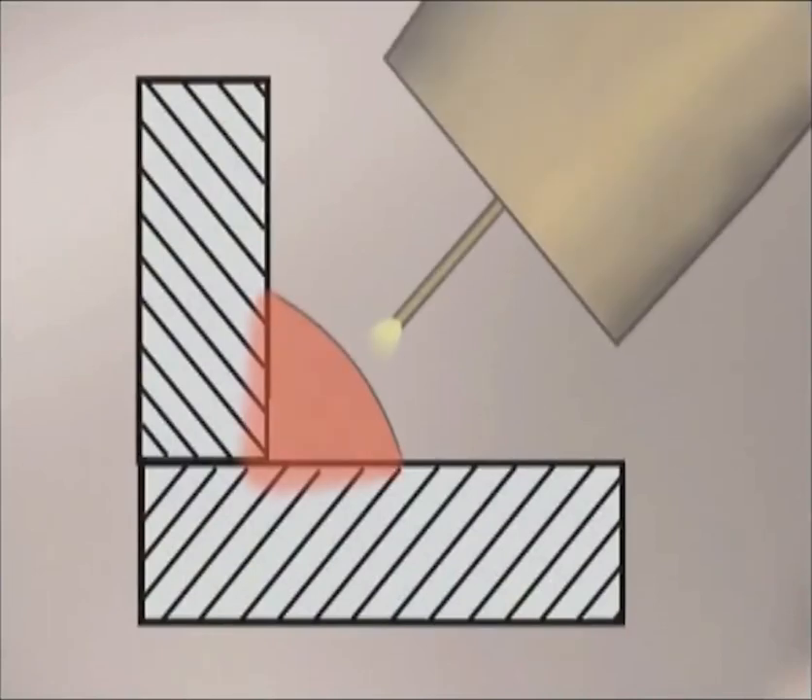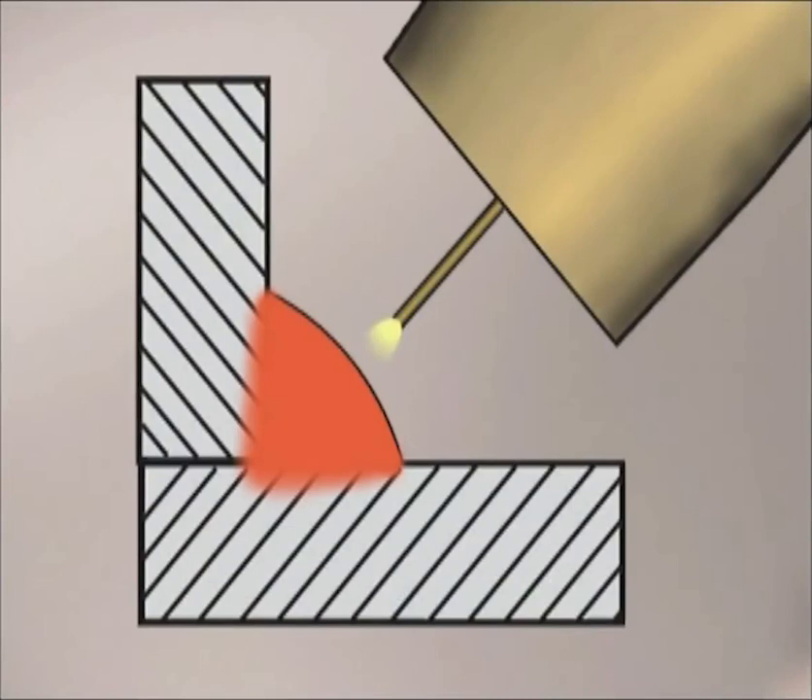In the welding industry, wire speeds and voltage are set to produce the maximum amount of weld deposit. In smaller shops, the idea of maximum amount of weld is not always necessary or desirable, especially while you are learning to weld. A certain amount of heat is required though for good weld fusion. Welding charts, located on the machine or in manuals, generally reflect the minimum voltage and wire speeds for different metal thicknesses. These charts do not always take into account the position of the weld or the amount of welder's skill. If you are working with 3/16 of an inch metal, the wire speed is adjusted so that a 3/16 weld deposit can be comfortably made in one pass.